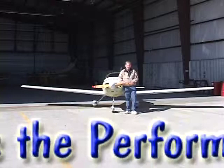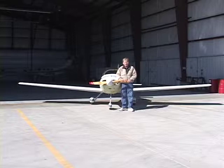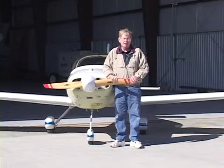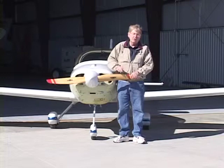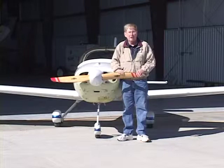This airplane is equipped with a Jabiru 2200. I'm still doing some work to adapt the Jabiru 2200 to the Pulsar because that wasn't a factory option to begin with. I originally had a Rotax 582 and flew it for many years that way. The Jabiru-powered aircraft climbs at around 1,400 feet a minute and will cruise at about 130 miles an hour; top speed is about 155 miles an hour and stall is around 48 miles an hour. With two people on board it suffers a bit — climb goes down to 1,000 feet a minute and top speed drops to 150 — but that's still very decent performance for a little sport aircraft.